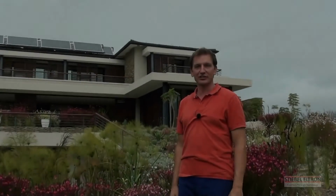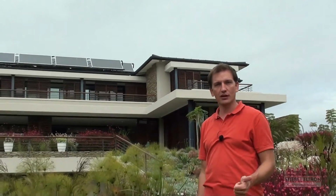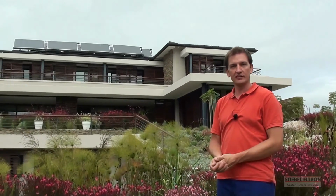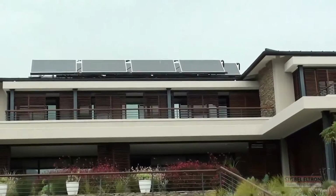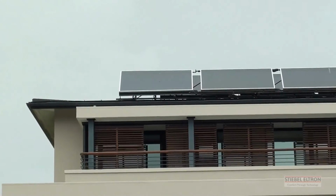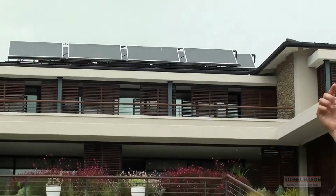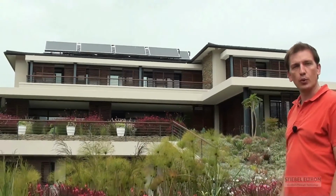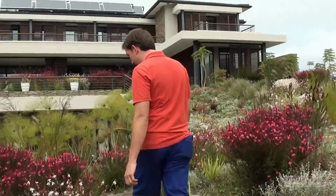Alright, we had another installation now where we have actually combined solar, heat pumps, and pool heating. We're going to just quickly have a look here. At the top there, you can see on top of the house two banks of solar panels. These are water-based solar panels, not PV, not electric. We circulate glycol through those panels and we take it down into a boiler room, which we can have a look at now. Follow me quickly. Let me just show you the pool that we are heating.